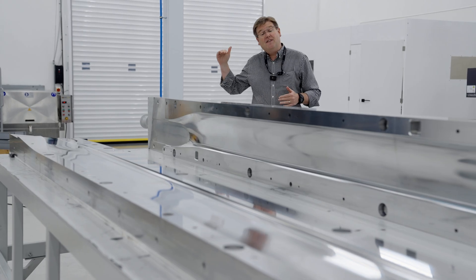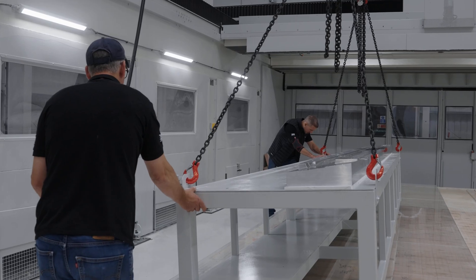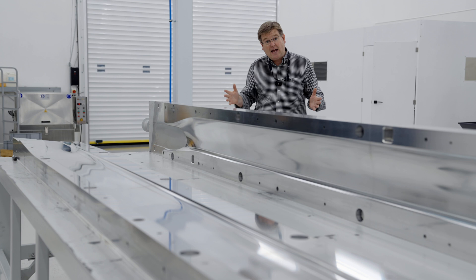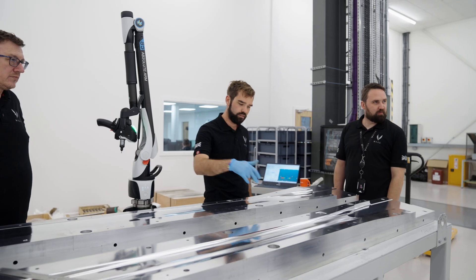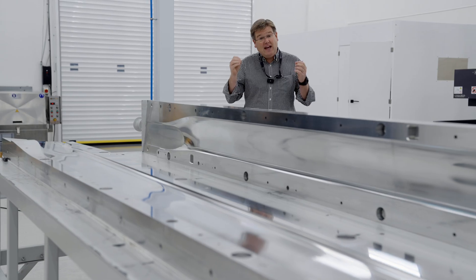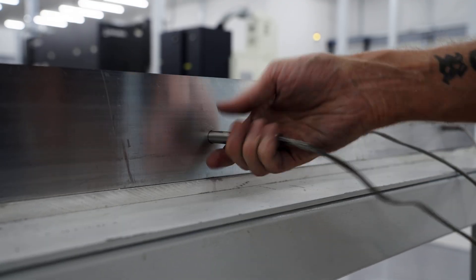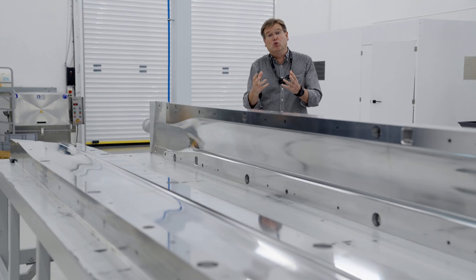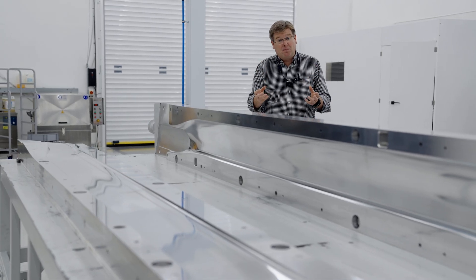We've got those off the machine, they've had all of their surface polishing treatments done, we've assembled them and disassembled them to make sure they go together properly, they've had all of their geometric inspections and are showing really tight tolerances, and they're just about to have the heater cartridges fitted in the holes that you can see all the way down the tool, to facilitate a controlled ramp up and ramp down rate for the precision curing process that we need to make these blades.